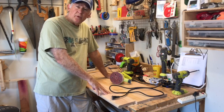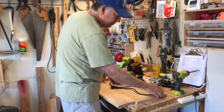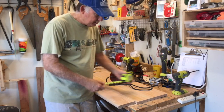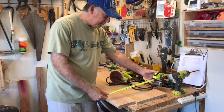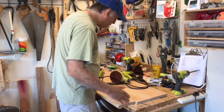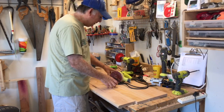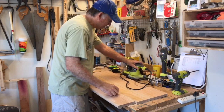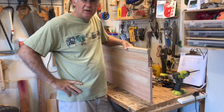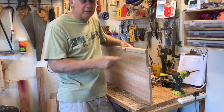Here's a tip about having your lumber and projects around the shop: there's a difference between a rough cut and a final cut. You can see this jagged end on this shelf is still a rough cut. This piece is 16 inches, but 14 and a half is going to be the final dimension. We're going to cut off this edge and square off both ends. The reason is you're going to move this around the shop and bump the corners and edges, and you don't want to have to redo those. I've already sanded this to 120, so leave it in rough cut until you're ready to start assembling that particular piece.